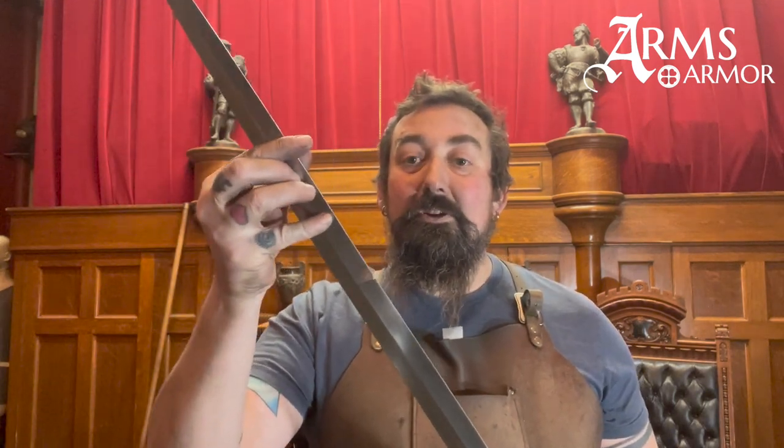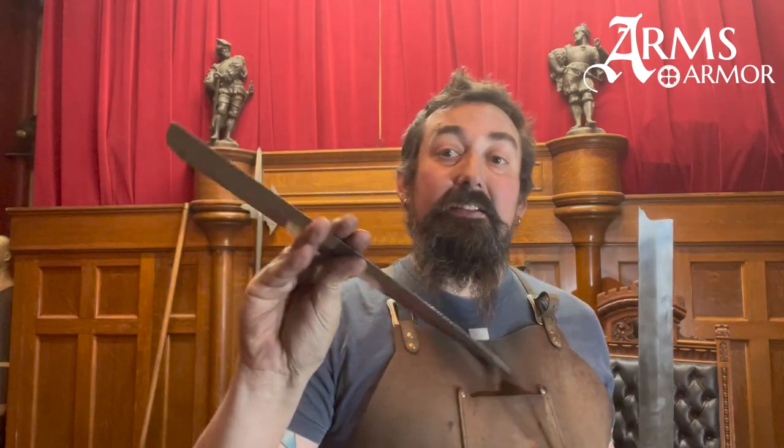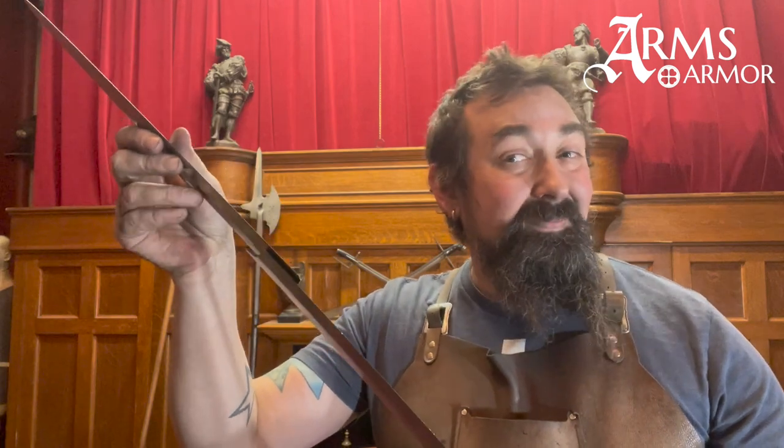The final question that was asked is if you could reforge this sword back together like in Lord of the Rings, and sadly, no, not really. It just wouldn't work very well. If you wanted to reuse this steel, which they definitely would have wanted to do in period, right? Steel's expensive, and if this is good steel, which it is, you want to reuse it. Instead of trying to forge weld this back into a blade, I think what you'd be more likely to do is cut the blade into shorter sections, and then you'd pile them up and forge them into a new billet that you could then draw out. Otherwise, I don't think it would work very well to just try and weld this back together and reheat treat it. You'd want to render it down all the way into a billet and then reforge it out, and then you could reuse it again.